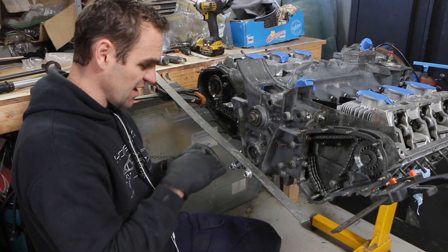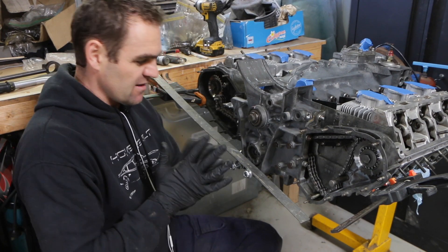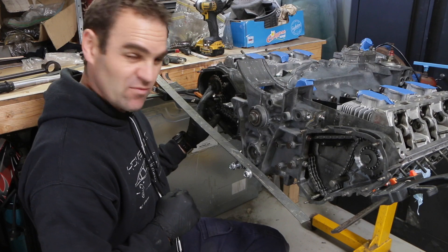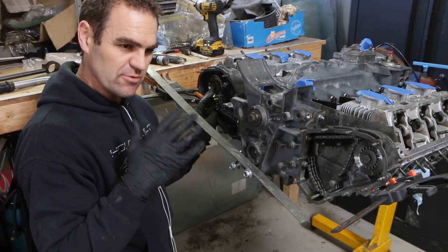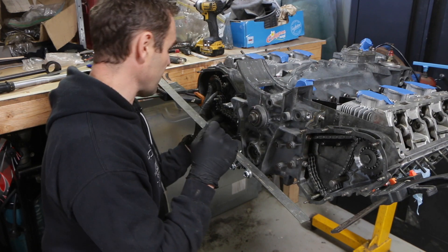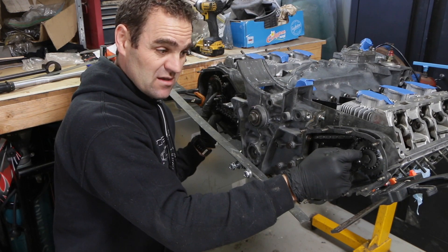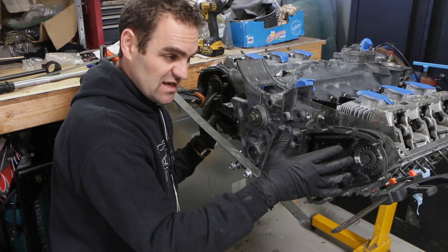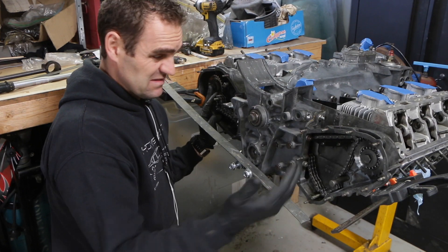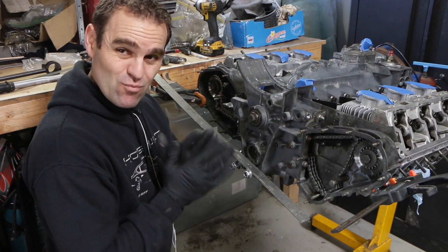That keeps it from twisting too much and helps get accurate measurements. It's still very difficult to get super consistent measurements, but from what I can see, I'm one washer extra maybe on this end — it's pretty close, about 0.2 of a millimetre. I can remove a 0.25 mil washer and I think I'll be almost dead on. This other end is about a millimetre out, so it's a lot out. I know there are four shims on here at the moment, so I'm going to take them all off, measure again, and see if it's right with no shims at all. I'll remove some shims and swap some things around and we'll see how we go.